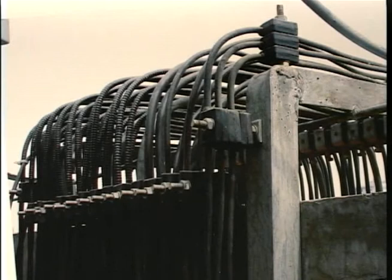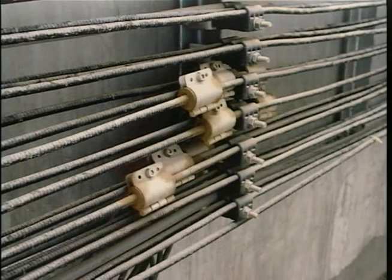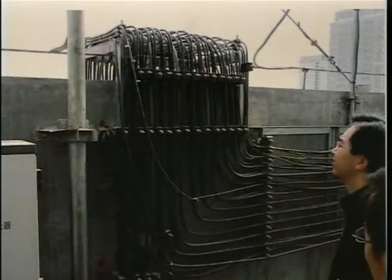The use of tower-top amplifiers has allowed the use of small coaxial cables as antenna feeders in cellular, WiMAX, and point-to-point microwave systems. But multiple runs of small coaxial cable are a nightmare to install and manage, and ground kits and installation represent a huge cost in material and labor. Individual small cables do not have the ruggedness required to provide long-term reliability in an outdoor environment.